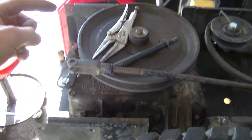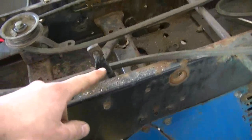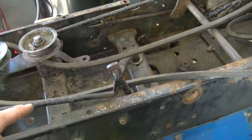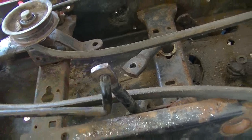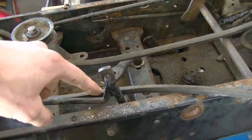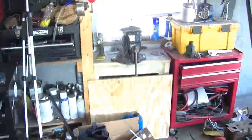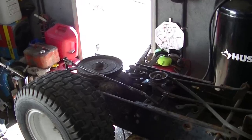Check out the shifter. I cut off the long piece and I'm getting ready to weld that. I took this piece that was originally on it over on the brake and put it on here, but in order to do that I had to bore this out. After I did that, I bent this arm because it was at like a 60 degree and that wouldn't work, so I bent it to a 90 using the vise. Now I'm getting ready to weld my shorter piece on. Got that done.